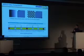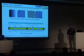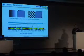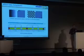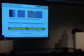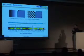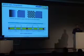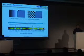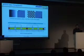These use data from earlier frames and from later frames, which also tells us MPEG-2 doesn't transmit pictures in the order we are watching them. So every picture has a timestamp, which tells the decoder when to display this picture. And this order is different than the order the pictures are transmitted. Well, and the P frames are easier than the B frames. The P frames only use previous data as prediction. So, well, it's quite complicated. Most of us don't want to do this at home, alone, coding that, using the standard as documentation.